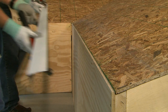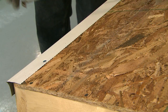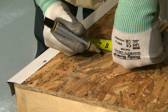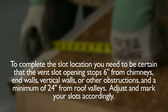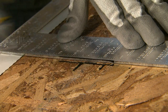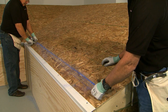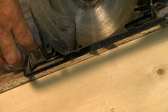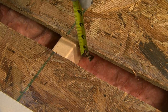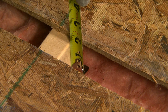First, we'll need to locate and cut the vent slot. Begin by nailing a drip edge along the entire length of the eave according to local code requirements. Measure up 6½ inches from the drip edge and make a mark, then make a second mark 1½ inches above the first. Mark the roof 6 inches in from each gable end wall to identify the ends of the vent slot opening. Snap a chalk line down the length of the roof on the marks you just made. Using a circular saw with a depth set to the thickness of the roof deck, cut and remove all materials from the vent slot opening. Look inside the slot to be certain that any attic insulation is at least one inch below the surface of the roof deck to assure proper ventilation.